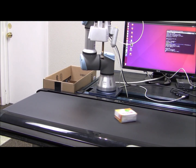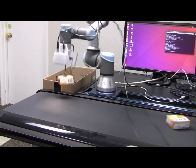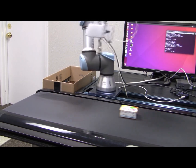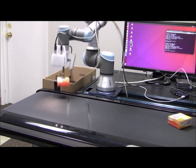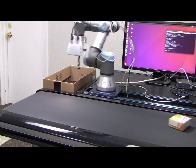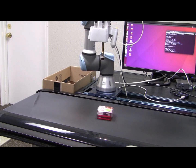Now let's look at Visual Robotics. Visual Robotics' patent-pending vision and motion technology enables the vision system to track moving objects and dynamically servo the robot to intercept them, even if their course changes. This means our VIM 201 system can pick boxes from a conveyor without any synchronization, without any special placement of the boxes on the conveyor, and without even knowing the conveyor's speed in advance.